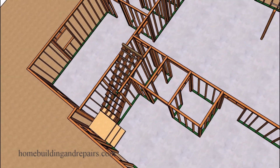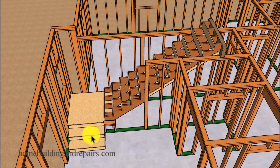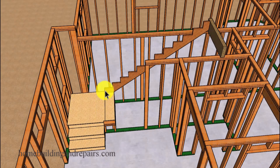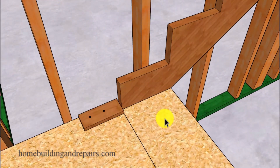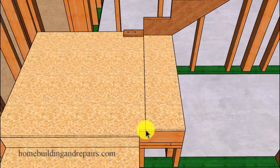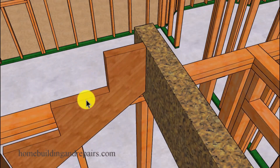And if you have a situation like this, you can build the landing and the steps below first and then draw a line on the landing where you want the front of the stringer to line up with. You could even install a block here if you need to prevent the stringer from sliding down while you're holding it up on the other side. To find this position, you're going to need to subtract for the width of the stair riser and the nosing if it's going to have one. In this situation, we're going to have a three quarter inch thick riser with a one inch overhang, suggesting that this needs to be moved back at least one and three quarter inches. Then we can simply cut one stair stringer and use it to locate the stair head out or support beam.